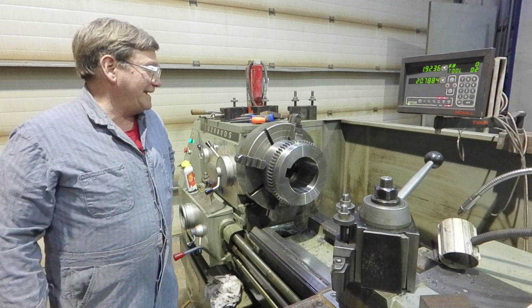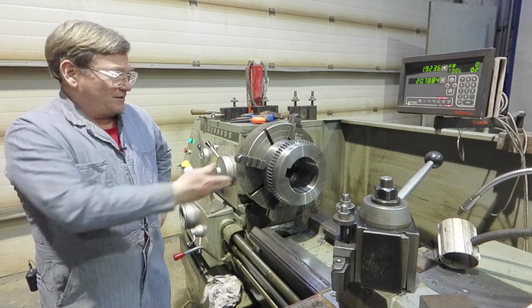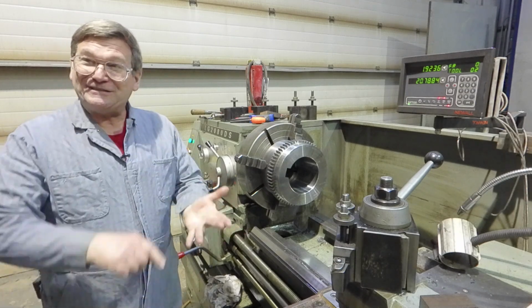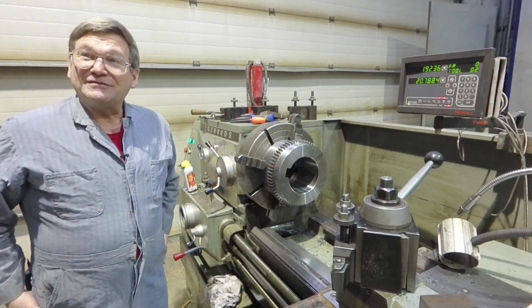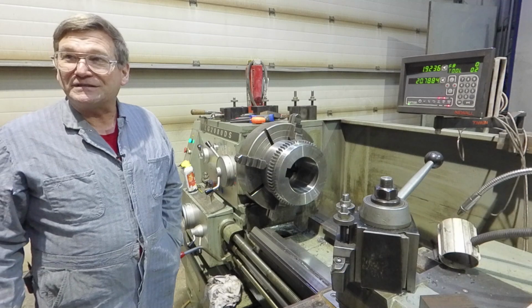The other thing I'm going to do is start setting up a bore gauge. We looked at those real quick when we were looking at measuring tools, and it's a nicer way to measure this than other things. Since we have an agreed upon number that agrees on my mics to within a tenth, and agrees with the customer's mic, we'll set our bore gauge to that number. Then when we're looking for the number we want, we know that all of our mics and everything will agree with that increase in size.